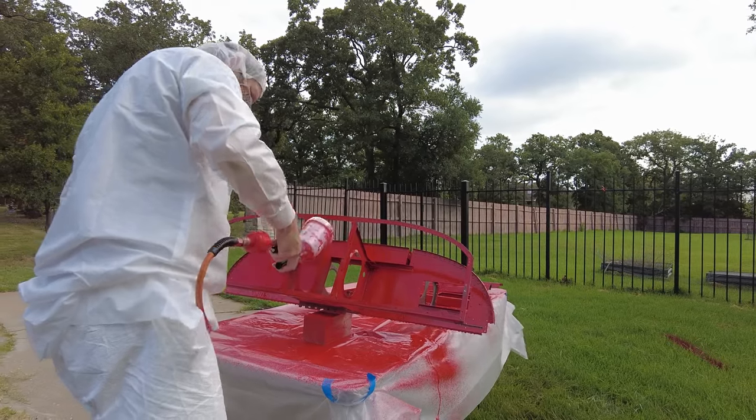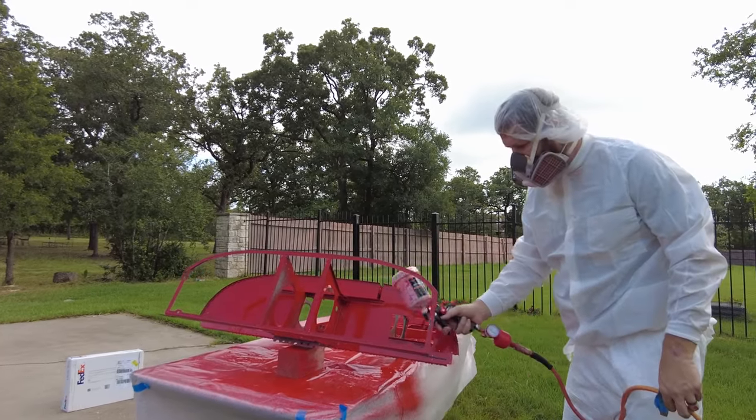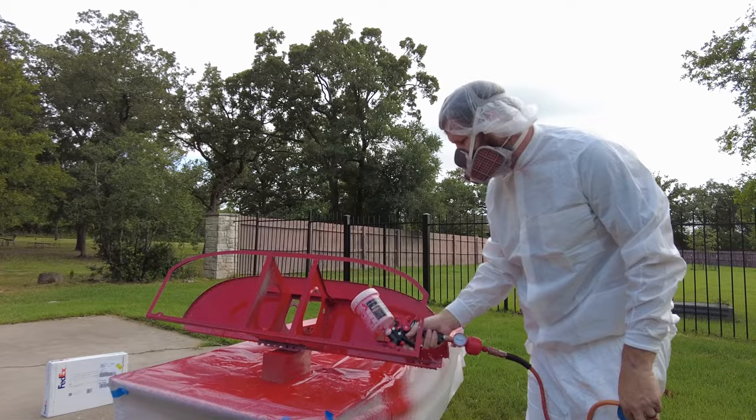We set everything aside for a while. The forward fuselage instrument panel is good enough — it's going to be covered anyway. Standing eight feet away from it right now, it looks great. Because we assembled so much of it, the spray gun couldn't hit every nook and cranny, so there are definitely flanges with base primer bleeding through, but that's okay — you're not going to see it. As for the side rails, we knew those would be visible in our build, so we had to redo them.